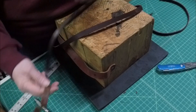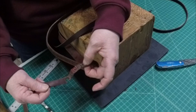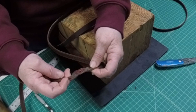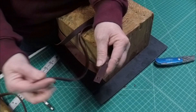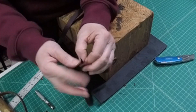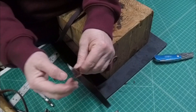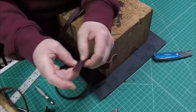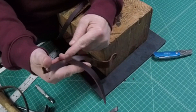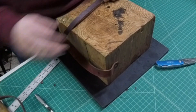Let me grab one of the old saddle strings. Here's a little hint on why I don't like the way they did these - see how that broke? When you do a hole it has to be a larger hole because this piece has to be able to go through that hole, so it makes this very very weak. So what I do is I do slits. If you're going to put this through that hole you're going to work hard to get it through and look at how it stretches that out and thins it even more. But if you use a slit, you take that and tuck it through and it comes through really nicely. Most saddle makers will actually just do a slit.